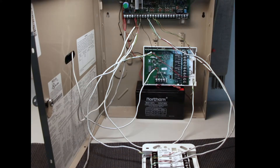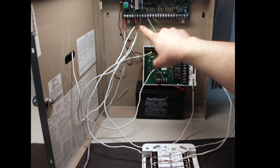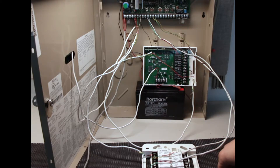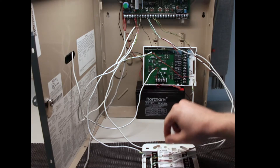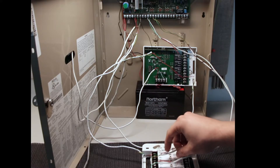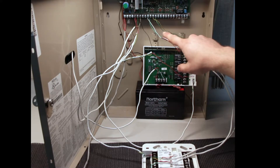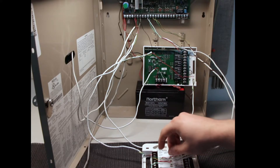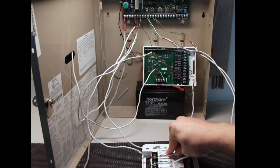We have to use the 4204 relay, and I'm going to walk you through the wiring. We have our AC terminals, keypad terminals — black, red, green, and yellow — and our zone terminals. Zone one is left blank because that is specifically for two wire smokes. Zone two is hooked up to the CO zone and zone three is hooked up to the fire zone on the Cosmod. The CO IDC positive and negative go to terminals 10 and 11 on the panel, and the smoke IDC positive and negative go to terminals 12 and 13.